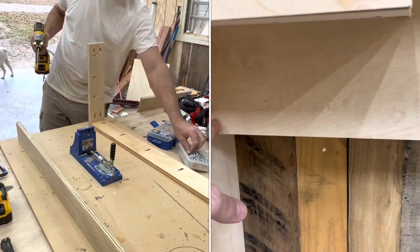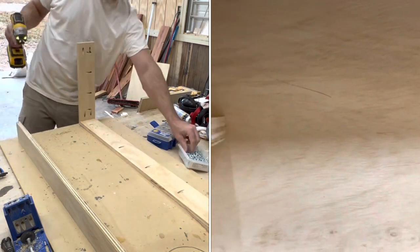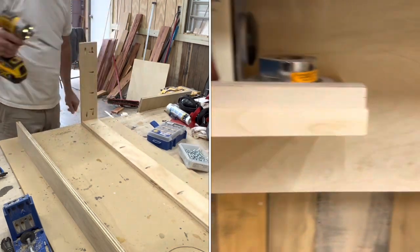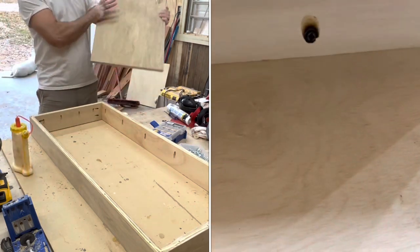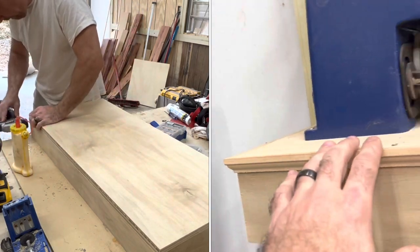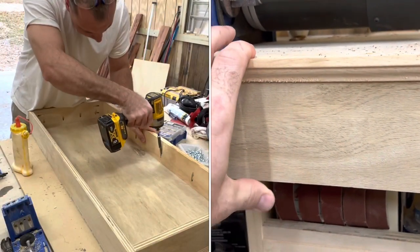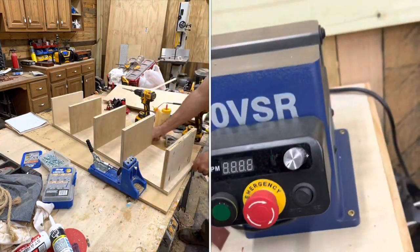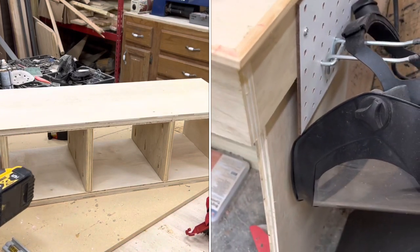It's just something I wanted to do. I built this little shelf for my sandpaper, sanding pins, and stuff. This piece I did not film adding, but it's just extra support — a back brace to keep it from racking. Basically all it is is this tower, which you'll see me building in the video, and then this side piece. It's screwed to the wall with about six or seven screws. And this is just trim from Home Depot put around it. The side pieces are cut at four inches wide. And I added this hook to hang my face shield on.